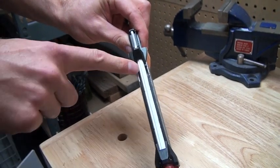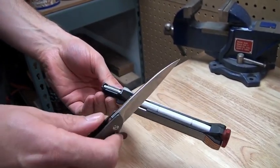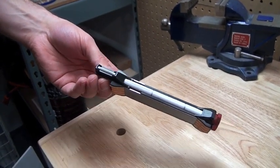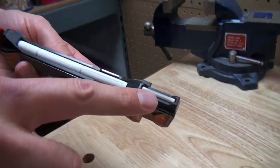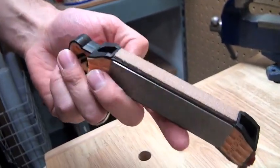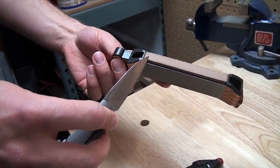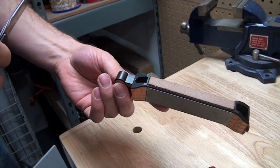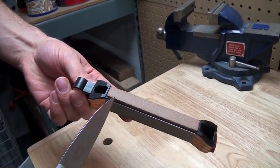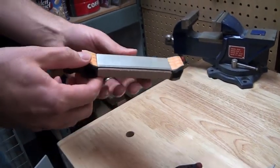The ribbed section of the ceramic behaves like a more aggressive ceramic due to the high surface pressure on the ribbing. Roll it one position and you have two fish hook grooves for large and small fish hooks. The third position is a smooth rod — so after the fine diamond, you come up angle-guided and maintain it all the way across that fine ceramic rod. If you have serrations, the small tooth of the serration can be honed in the small groove and larger ones below. To finish the edge, there's a leather strop with an angle guide. It comes pre-conditioned with a slurry of mink oil and half-micron diamond paste, heated into the leather so it's ready to use out of the box — an angle-guided solution from coarse diamond all the way through a leather strop.